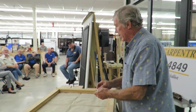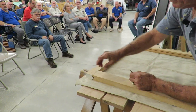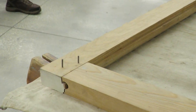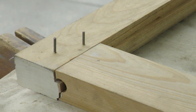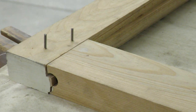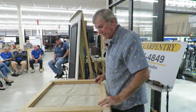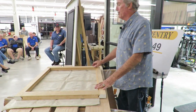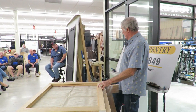They are simply held in place with nails that I've cut off. This is a six-penny nail, and I cut it to the thickness — this is one and three-eighths, so I probably cut this nail at one and one-eighth. You can't take it apart. That is exactly historically how they've been manufactured. They never glued the joints.